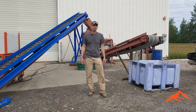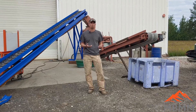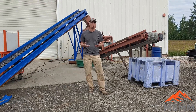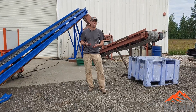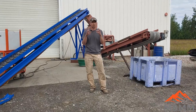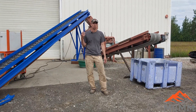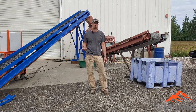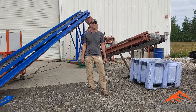There are the results of our glass crushing video. With the half-inch screen you can do a whole lot more throughput, but it doesn't crush as fine. For the finer screens, it's going to reduce your throughput and the material also needs to be really, really dry. If there's moisture in it, it'll clump together and clog up the screen. So if you want really fine crushed glass, it needs to be bone dry so it can fall through the screen.